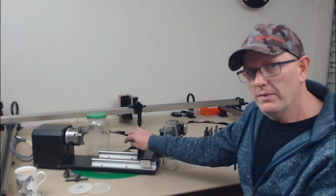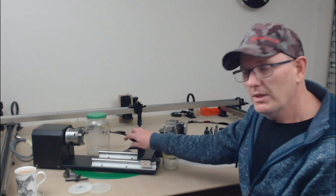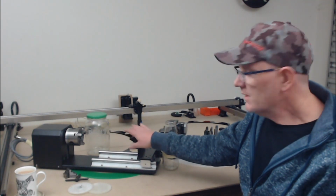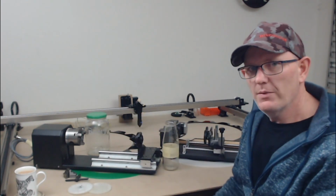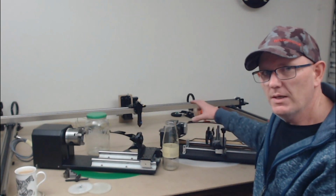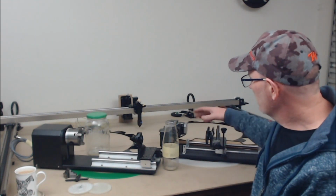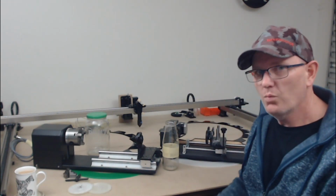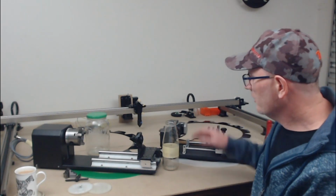I think when it comes down to it, the chuck rotary axis is a lot easier for calculating your steps per revolution and things like that. And you only then need to calculate the diameter of your workpiece. But the roller rotary axis does give you the ease of replacing objects very quickly. If you're doing production pieces and they're actually the right weight and they're going to turn effectively, then the roller rotary is the way to go.